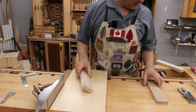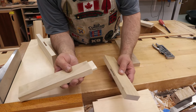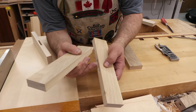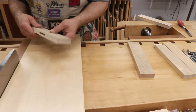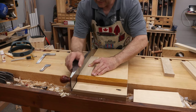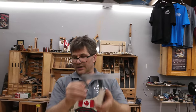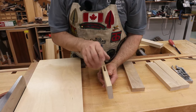Second tip: the corresponding piece — this is the one with the mortise — needs its face to be square as well. These shoulders are going to be parallel to the end of the tenon and square to the piece. Which means when they fit into the opposite piece, as long as that mortise has been cut parallel to the sides, this face needs to be nice and square. If it's small enough, do it on the shooting board; if it's too big, do it held up on the bench. Either way, you've got to check it — referencing off the face — and make sure that this is square to the face, so both shoulders will come together at the same time.